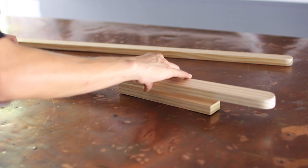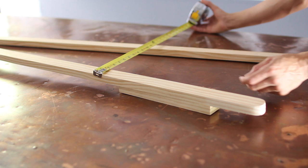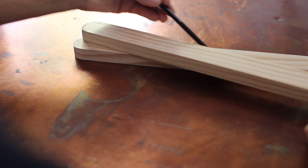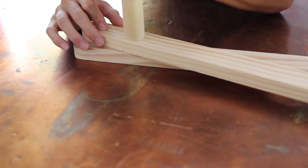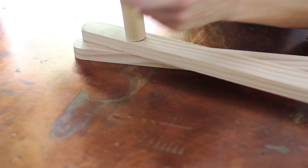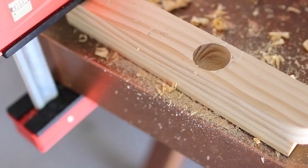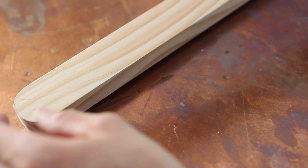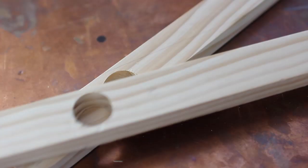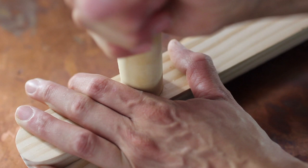Grab two of those one-by-twos and lay them out on your table and stack them as if you are going to be creating the leg of one side of the wardrobe rack. Since the shelf is not assembled yet, I just grabbed my measuring tape and pulled apart those pieces of wood until it was the depth of the shelf. I traced where the two pieces of wood met towards the top and then grabbed my dowel, centered it in between one of the pieces, and traced it — all as a guideline. I drilled out the holes with the Forstner drill bit that was a little bit smaller than my dowel to make sure I wasn't taking away too much wood. Then I laid that cut-out piece back on top to confirm the fit, traced that circle onto the other piece, and repeated the process so our dowel can go straight through. When you double check that that works, you just copy and paste essentially with your pencil onto the other set of legs.